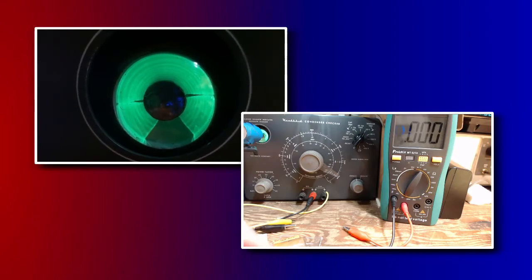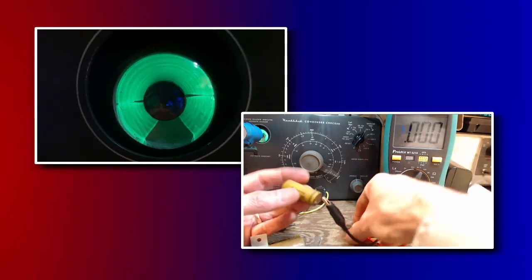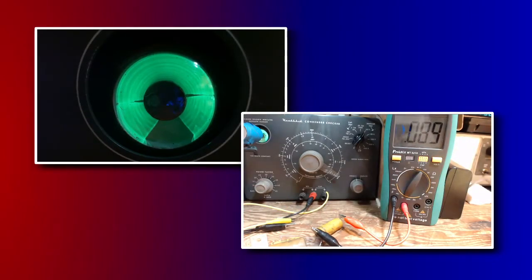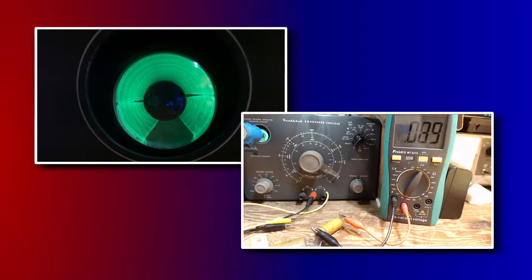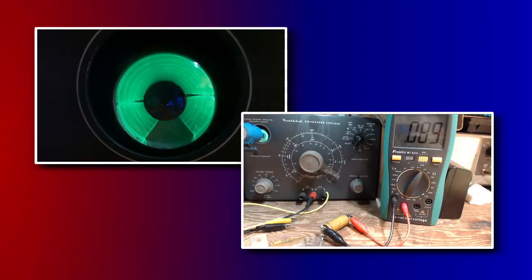Okay, so let's go on to the next one here. This would be C10, 0.05. Last time I read crazy values on this capacitor. I read 0.14 on this meter. Now I'm reading 0.09 basically. Why the big difference from the last time around? 0.089, just writing that down.